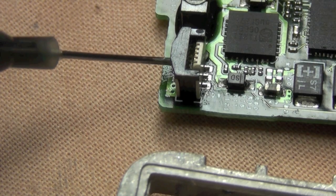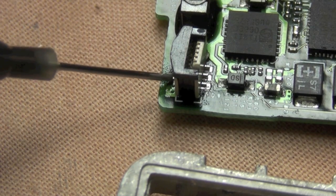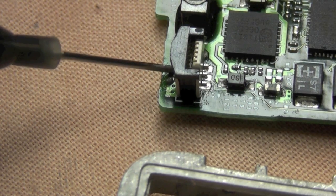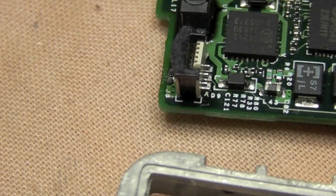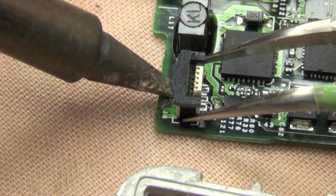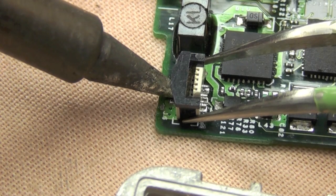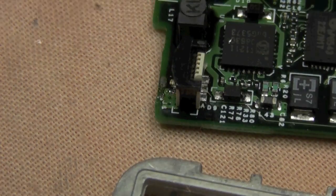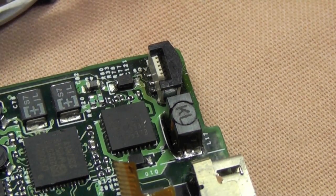It is quite expensive, about 25 pound — I don't know how many mils are in this tube — but I've had it for ages and you don't need much of it. The good thing about it is solder balls held in suspension of flux, so I do not have to hold a piece of wire; I can hold the component and just solder. Really good stuff — if you're doing a lot of soldering at this sort of level with small components, well worth investing in a tube of liquid solder.